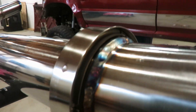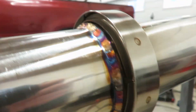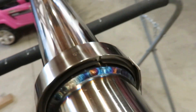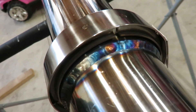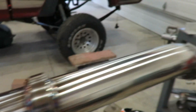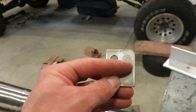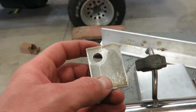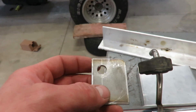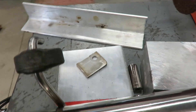This whole system is fully welded - just got these v-bands. The welds turned out really nice on these. It's a lot easier to weld these v-bands because the material is so thick on that v-band, it doesn't get as hot. Turned out pretty good. Right now I'm building a little bracket for the downpipe - I got that piece and some of this rod I'm gonna weld onto it, and then that bolts right to the tranny. I'll get it tacked together and up in there and show you what I came up with.